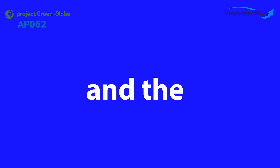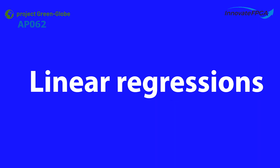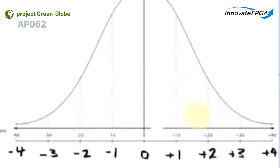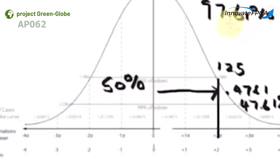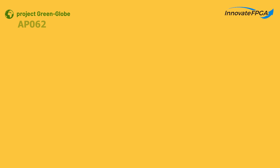The previous and present values of temperature are taken to predict the temperature forecast using linear regression. The collected temperature values are taken to perform Z-score analysis. The Z-score analysis is basically anomaly detection. The program creates a boundary for the flow to schedule the timing to deliver the water to plants accordingly. It is defined in the code previously that the amount of water required for plants.